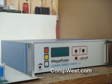These two tests both use a 5000 volt pulse, but the wave shaping network — made up of an inductor, a capacitor bank, and resistors — is different for each test. However, both tests use a 32 microfarad capacitor, and this capacitor bank is the heart of the D-Fib-5.